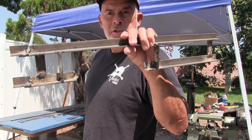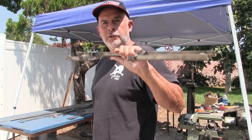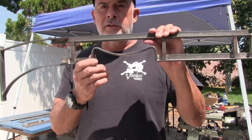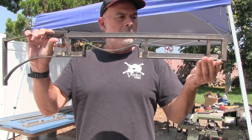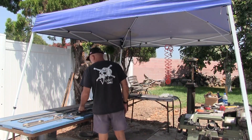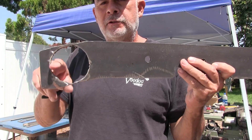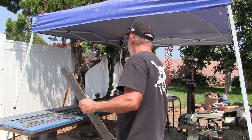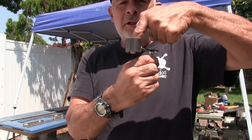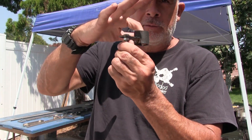It's Tuesday. Here's something — I started a jig to make cuts with the plasma cutter. It started off good but ended in disaster, so I took a couple days and moved on to another one. This one I think is gonna work. For the circle issue, I had to make a jig — basically a pipe nipple with a quarter-inch bolt. You need a quarter-inch hole, and then you go around with the torch — the torch goes in there. This has to spin nice and free; you can't get hung up on anything because that'll mess you up.